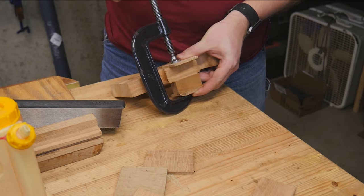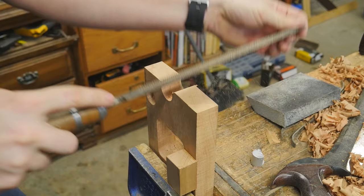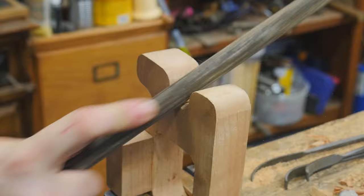I'll be able to put bolts through this to then hold the iron in place in the cutting hole. For the actual shaping, I'm going to be using rasps and files — choosing different coarse rasps to fit the shape and working around it until it actually rounds out. Then I'll come in with something a little finer, and a little bit finer. I have a whole series of different files, rasps, and rifflers that I can use to clean this out and make it really nice and smooth.